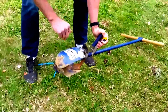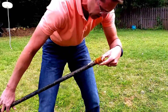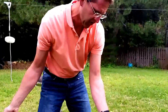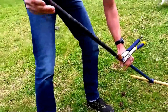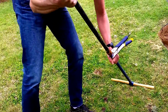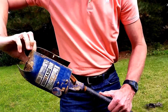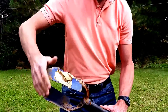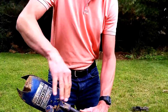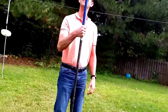I definitely recommend putting grease on the pipe threads before you connect it. So now we have another length of pipe — it's fairly clean, don't need to grease it. It's a four-foot length of black pipe, three-quarter inch, with a coupling on the end. I can start by screwing it on. When tightening it, you don't need to tighten it all that tight because the natural twisting motion of the auger will tighten it on its own. I'll screw the other end on — it's really easy. It's tight enough; take the vise grips off.